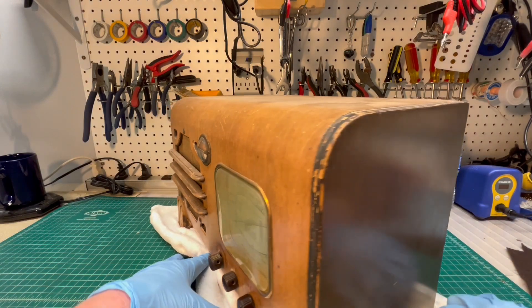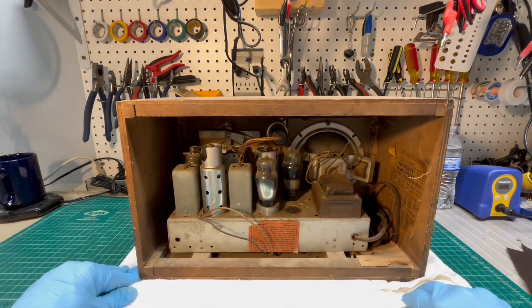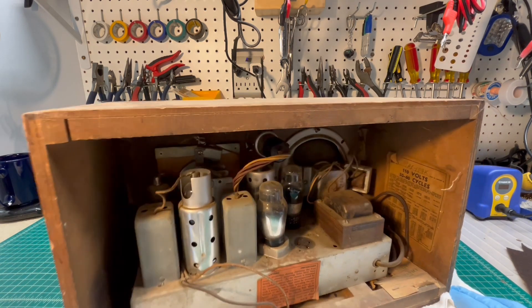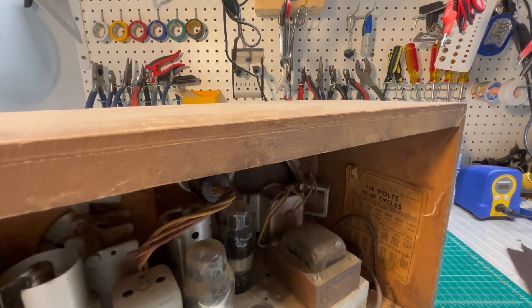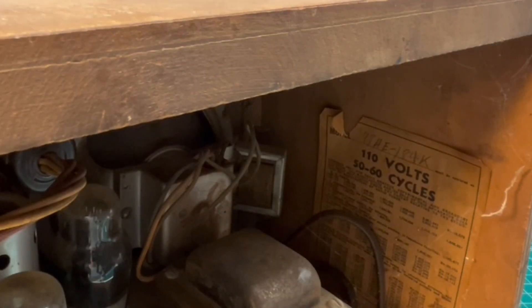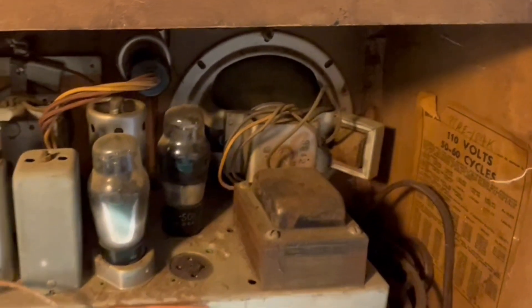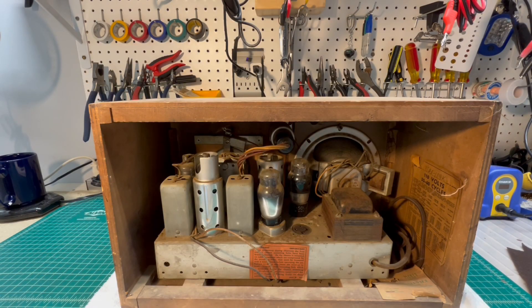Let me flip this around and take a look at the backside, including the cobwebs that come along with it. So again, untouched. Let me bring this back around so you can see the model number — that's showing up as 98 Alpha Echo dash 184K. I didn't find an exact schematic for that model number, but they say that's not uncommon with the Knight receivers. It's just a standard six-tube, two-band receiver. I have a matching schematic we can use as a guide, and then we can determine what's different with the published schematic versus what's in the radio.